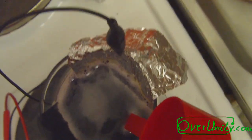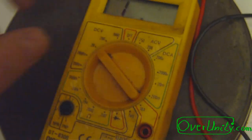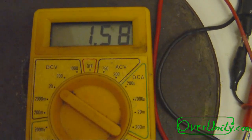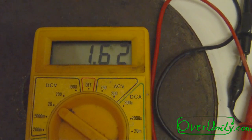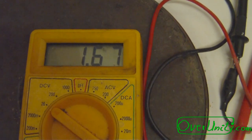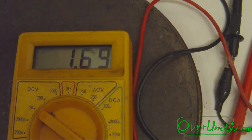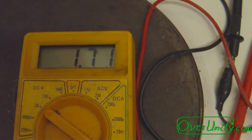Now it's going down a bit. Let's get back to the voltage again — now it's open circuit voltage, still rising again: 1.64, now 1.66. Well, that's quite a good cell for this minimal cost. If you put a few cells in series, you can drive a few LEDs or similar devices with it.